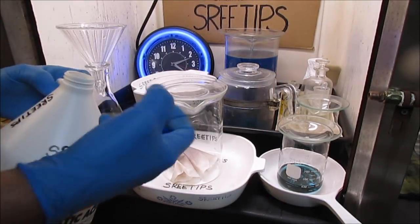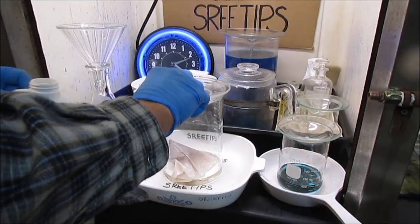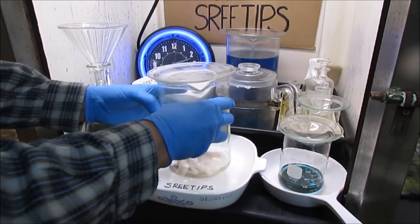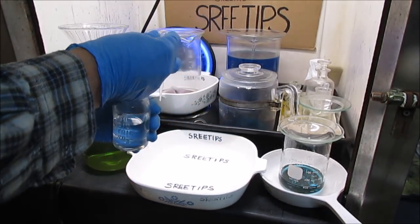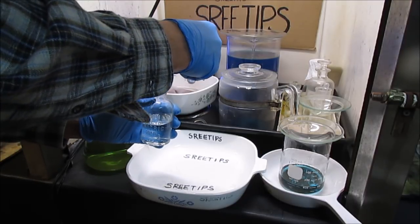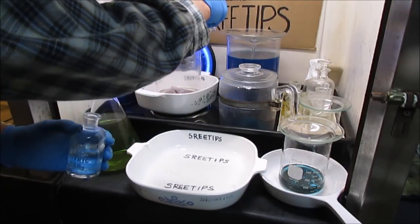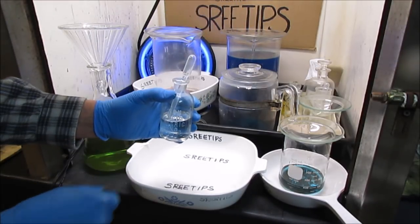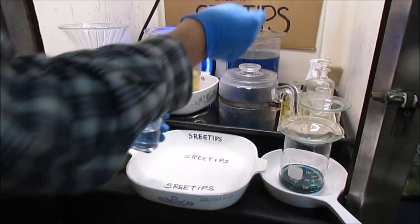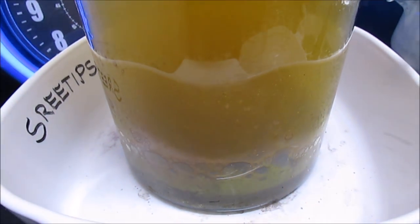Now I'll add about 200 ml of hydrochloric acid to the filter and the filings. The filter paper will just go ahead and disintegrate. I'll set the beaker with the filter and filings up on the heat. Next I'm going to add some nitric acid to the mixture — about 12 ml of concentrated nitric acid total. Immediately you can see a pretty good reaction starting. I just stirred this up by swirling it — there's a good reaction going on in there now.